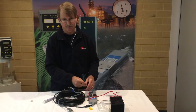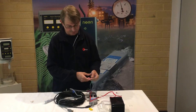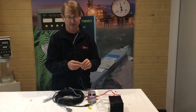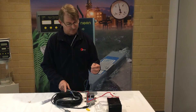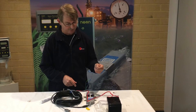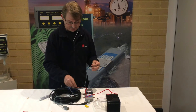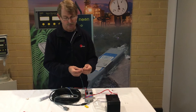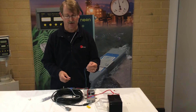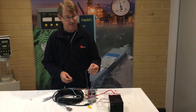There are three additional wires which come out of this connector. The purple wire is the SDI-12 signal cable — if you desire to use the Starflow instrument as an SDI-12 instrument, you can do so. There is also a ground wire and a control wire that can control such things as an external water sampler. More on that will be covered in an advanced video.